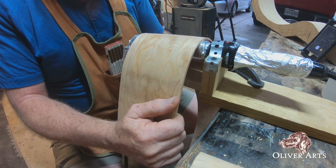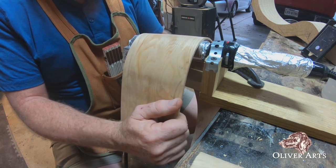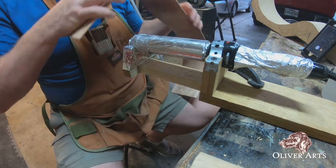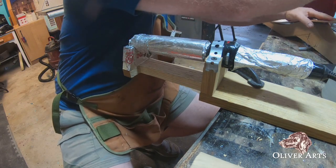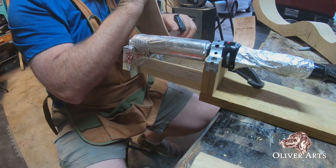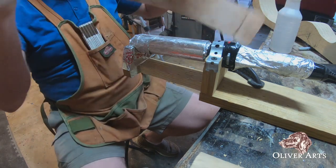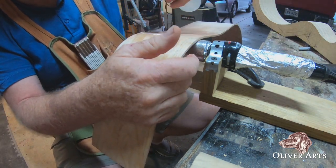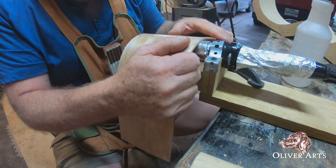The wood doesn't become stiff — it has a lot of flex to it. The first step is getting it steam bent to shape, then putting it into a form or another jig, which you'll see in the next segment. My bending iron is extremely fancy: it's a Revlon curling iron I picked up at the local grocery store. It works just as well as any commercial bending iron, has variable heat control, and for about twenty dollars you've got yourself a bending iron — a lot cheaper than one commercially made.